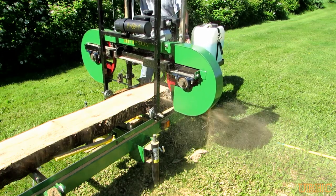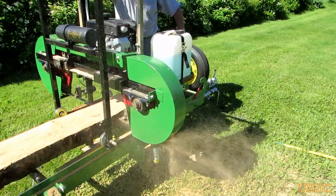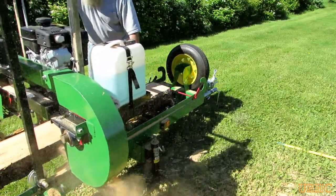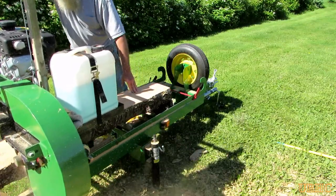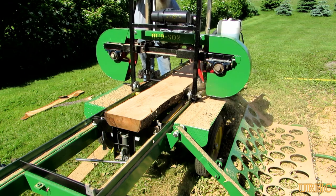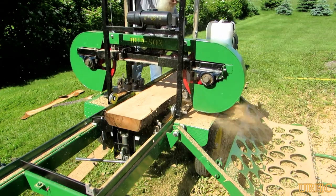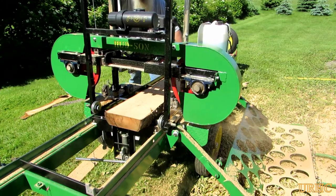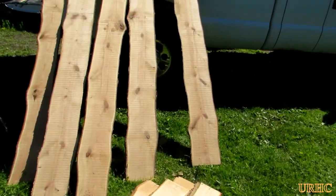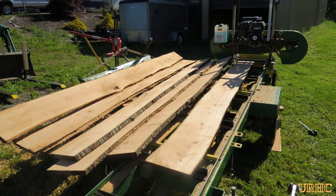This cherry is really dry — you can see how fine the sawdust is coming out, like super fine. If the wood is still wet you get a stringier sawdust. It cuts like butter though, and I'm using the 10-degree blade still because that's all I have. All in all I spent a couple hours messing with it and got some really nice cherry boards out of it. After cutting these cherry boards I went on to cut some ash logs into tomato stakes, but the video would have just gotten too long so I'll break that off into another video on its own. Thanks for watching — please subscribe.